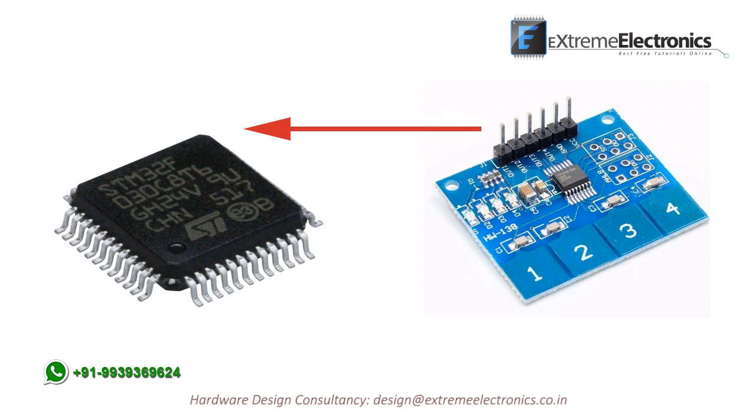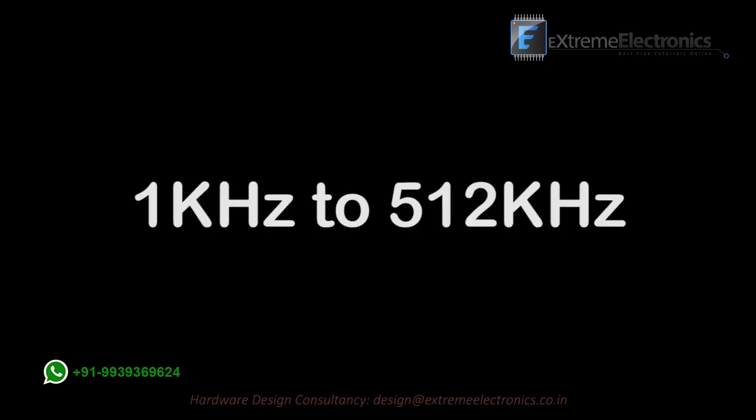for 16-button mode. The data order is LSB first. That means the first bit read corresponds to button 0. Then the next one is button 1 and so on. The range of clock frequency is 1 kHz to 512 kHz. To be safe, we will use a frequency of about 200 kHz. For that, the delay should be about 2.5 microseconds.